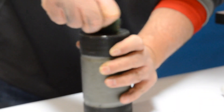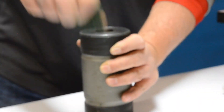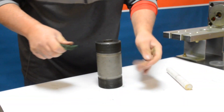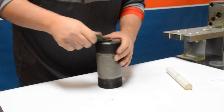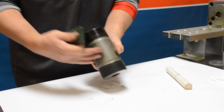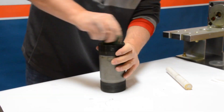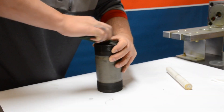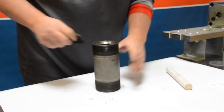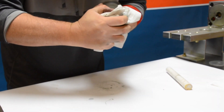Continue to take a look at that surface, brushing debris away, and it should have a fairly nice-looking finish by the time you're done. Flip it over and start on the other side, cleaning it to the best of your ability. Once you're done cleaning the top and bottom surfaces, clean your area and get ready to clean the ID of the cylinder.